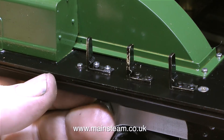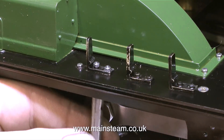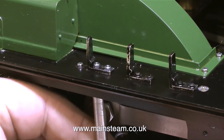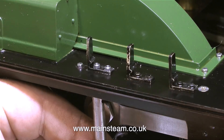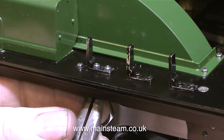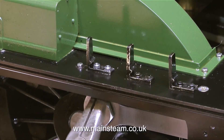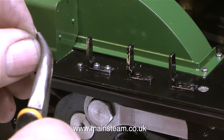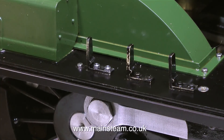In this clip you can see how much thinner the modified bracket is than the other two. Here's a top tip — it's not a particularly good or clever top tip, but here it is anyway. When using very small bolts on models, often you have to use the bolt longer than you need it to engage the nut on the end of it. Then the bolt is too long, so the best thing to do is just snap it off with a pair of pliers like this. Not brilliant engineering, I know, but it does the job. If the broken part of the bolt was visible, you could always clean it up with a needle file.